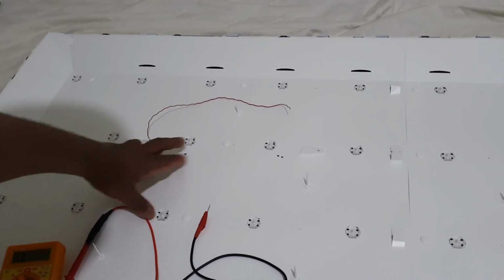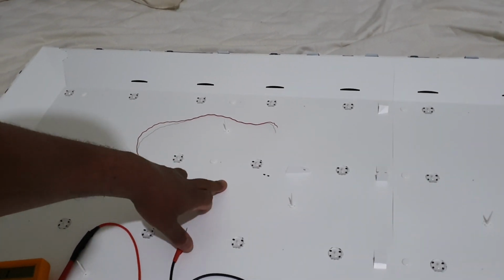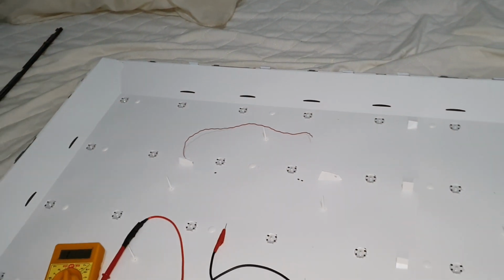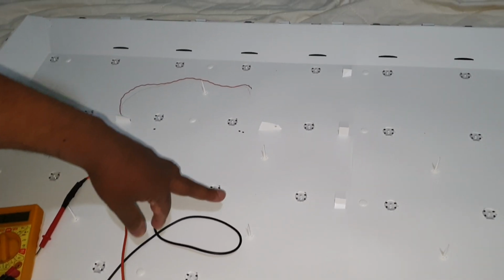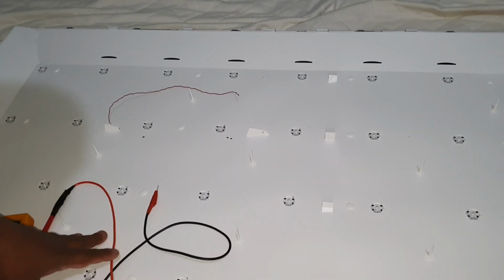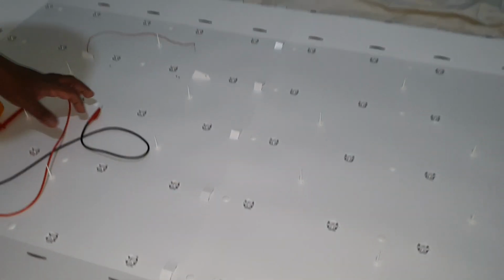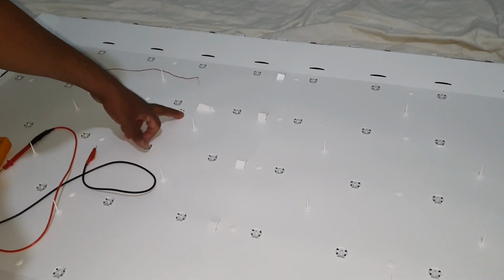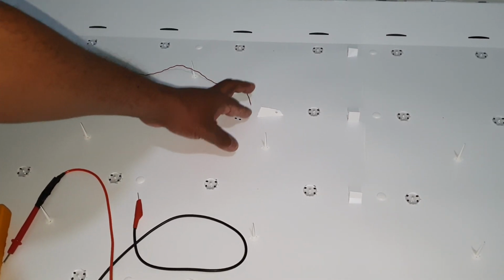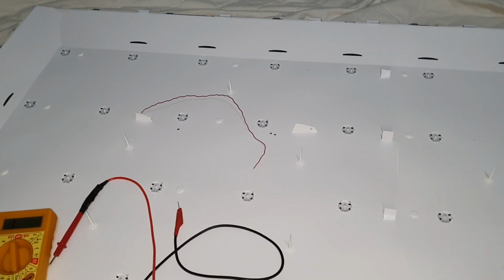So I thought these are the faulty LEDs, and they have some issue, therefore they're drawing low current. Then the LED driver circuit detects this low current and turns off the backlight driver circuit completely, and displays the LED blinking to indicate there's an error. So what I did, before replacing this diode, I just short circuited this path using this wire. Then what happened?